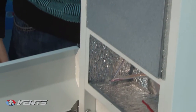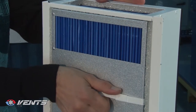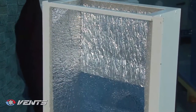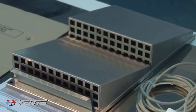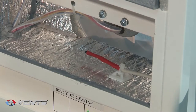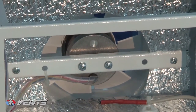The front panel rests on rotating sleeves and enables servicing access. The G4 supply filter between the fan and the heat exchanger serves to clean the supply air. The extract filter is located in the upper part of the front panel. An exhaust air temperature sensor downstream of the heat exchanger provides heat exchanger freezing protection. As the exhaust air temperature falls below 3 degrees Celsius (37.4 Fahrenheit), the freezing danger signal turns the supply fan off and the unit operates in exhaust mode only.